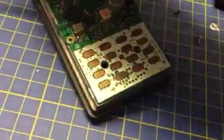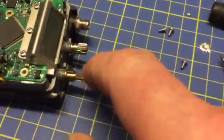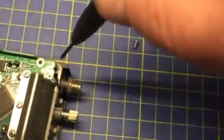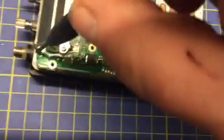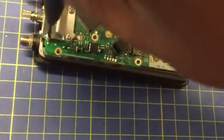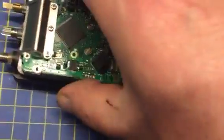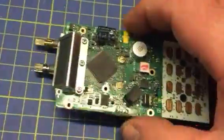Take that. You'll find that the board's quite tight — it won't come out. Whatever you do, don't do what somebody's tried to do, which is undo this. Simple enough. There is a screw just there which attaches the antenna to the board. It's a long screw — don't lose it. Simply remove. The board — now simply lift out.